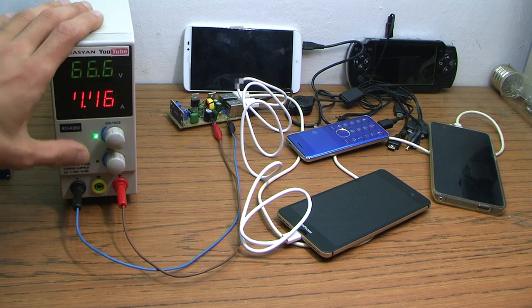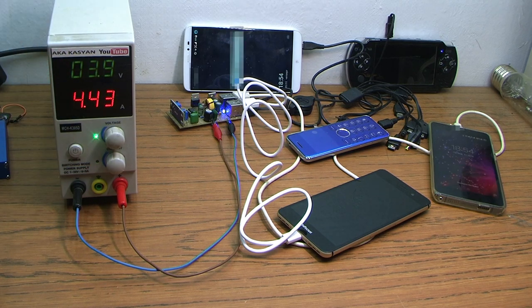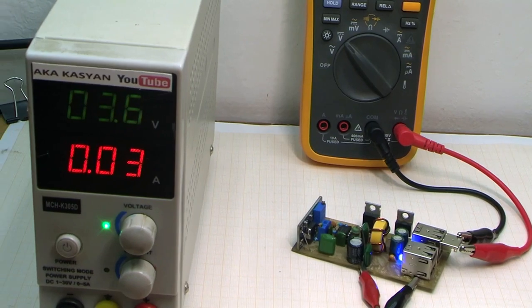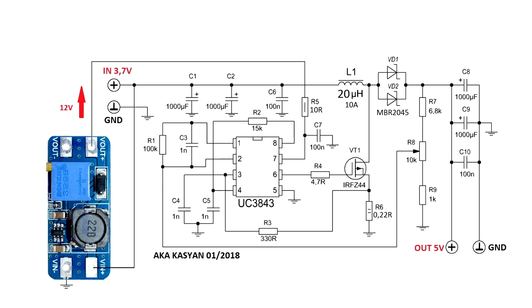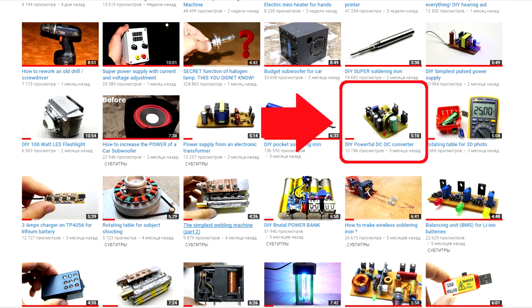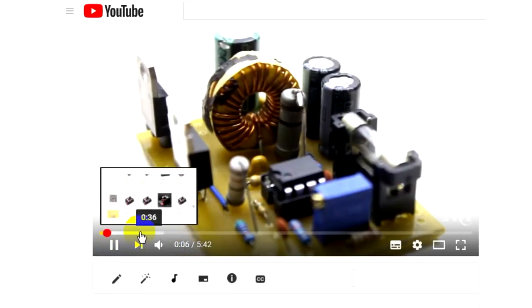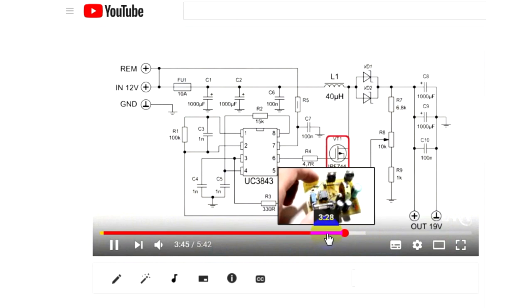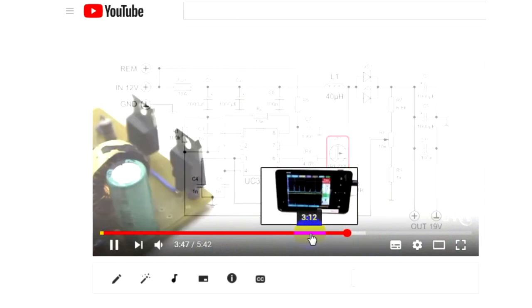I coped well with all the tasks, stable and most importantly for a long time. It can give 4 to 5 amperes without a significant output voltage drop, and the idle current is only 30 milliamperes. There is nothing special in the circuit. Earlier, I have already shown and explained the principle of operation of a step-up DC-DC converter. In the description is a link to the mentioned video. I advise you to study it.